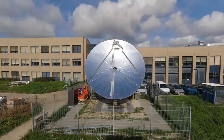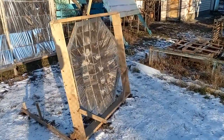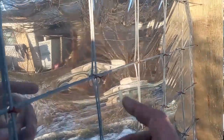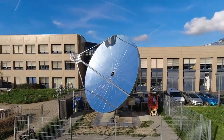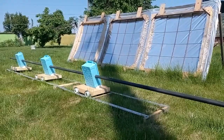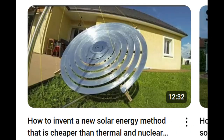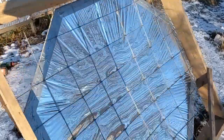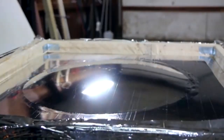It turns out that each square meter of this traditional rotating mirror dish produces about 3 times more thermal energy than 1 square meter of our cheap mirror, but I remind you that it is several dozen times cheaper. The main reason for the differences in heat production is the fact that the rotation of the dish allows it to give us energy almost all day long, from morning to evening, while our motionless mirror works during 4 or 6 hours around midday. Some of my videos have explored the disadvantages of our cheap mirrors — for example, wrinkles of the film also reduce the efficiency, but my old video showed three options on how to get rid of those wrinkles.